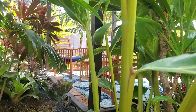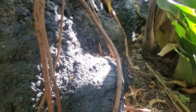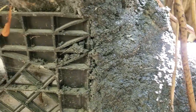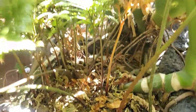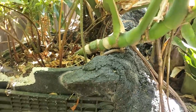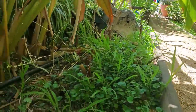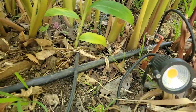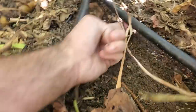You can see over here is the gazebo. As I pan over, you're going to see we've got some aerial roots and some lava rock, until you get to about this point right here — and all of a sudden we've got a crate with a styrofoam container with all manner of ferns and philodendrons growing right out of it. That's pretty much the back behind-the-scenes version of my backyard. I'm an artist; I never claimed to be an engineer or a landscape designer. From the faucet over there, the timer feeds half-inch drip tubing through here, and there are little quarter-inch drip tubes that go off and feed all the gingers. Right here as it starts to turn the corner, I'm going to attach a half-inch line to go to the front yard.